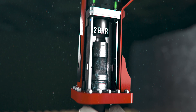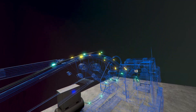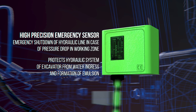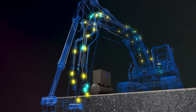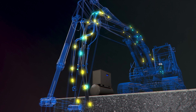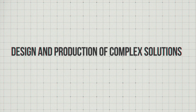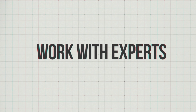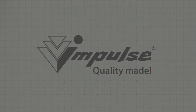The most important feature of our underwater kit is protection against water hammer. The emergency stop system monitors the pressure in the control line in real time. When pressure falls or lags, it stops the supply of the hydraulic line that feeds the equipment.